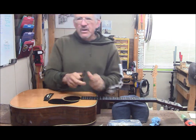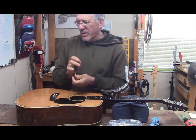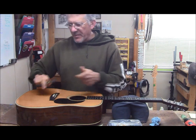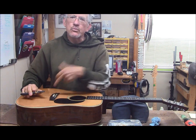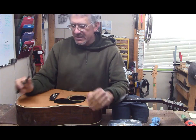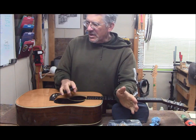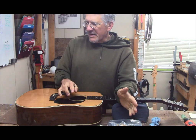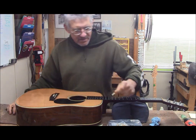So. Now, okay, so you watched me do this, right? This is a pair of angle cut pliers. A lot of people are horrified that you're prying off of the saddle here. Why don't you pry from the back of the bridge? Why don't you pry from anywhere? If you pry from the back of the bridge, you will put dents in the wood. Which is harder, ebony or bone? Do you have ebony saddles? No. Well, you can, but they don't last very long. You have bone saddles. You're way better bending, prying off of the bone than you are the ebony. Besides all that, you're really not prying. All you're doing is getting down here at the bottom, kind of giving it a little pop. It's really not even any prying at all. It's a very easy, gentle prying. Here, this one's coming out. There we go. Got that one.